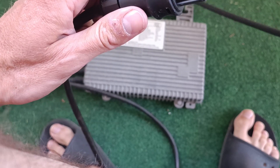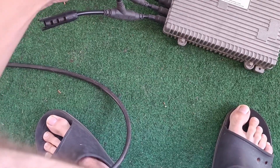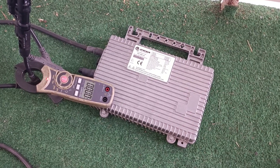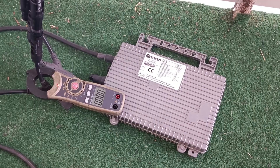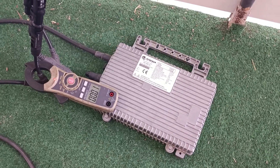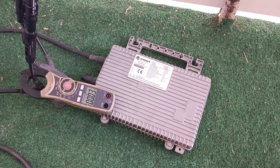Let's plug in AC. No pop. Let's plug in DC. Still no pop. Now it takes a couple of minutes until it actually engages. Some people will tell you that it takes the inverter like three minutes to synchronize to the grid. Technically that's not quite correct because all the Chinese ones will start immediately. This one even has it written on it — two minutes, 20 seconds — and it's a legal requirement. The inverter has to monitor the grid to confirm it's within normal frequency and voltage ratings, and only then is it allowed to feed in energy. That's why the wait time exists.